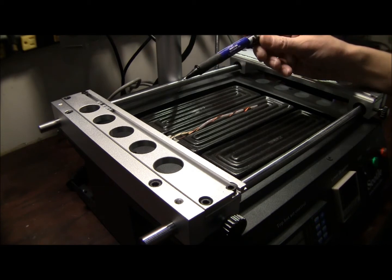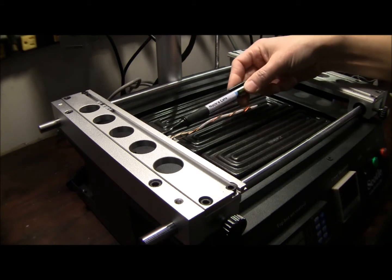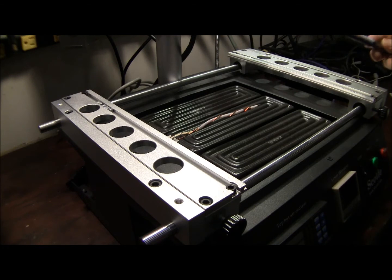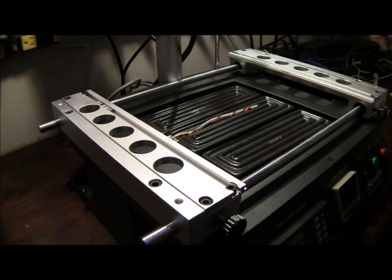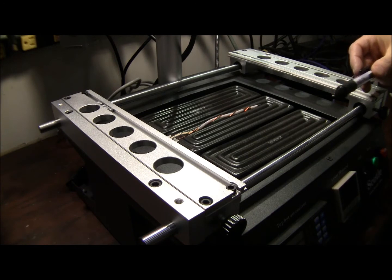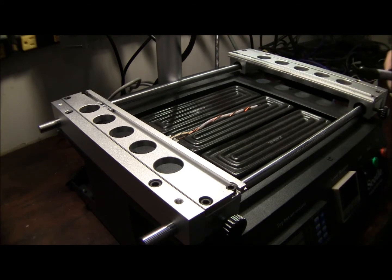This machine has a lower heater probe originally mounted right here, stubbing out of this socket and sticking out over the board about an inch. With foreign-made machines, lower probes are always tight against the plate. If your board is up here and your sensor is down on the plates set to 180°C, your board will not be 180°C. We want to eliminate that discrepancy, because your lower heater is for preheating your board and bringing it up to temperature.